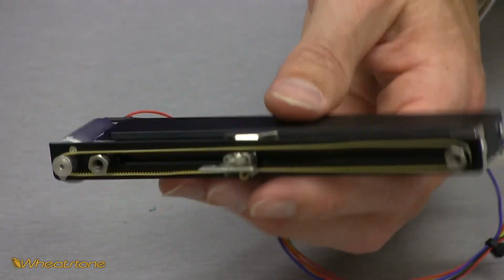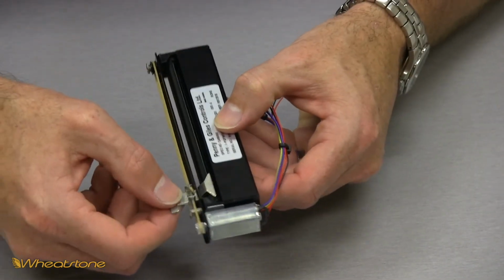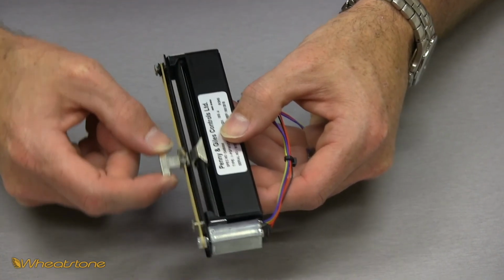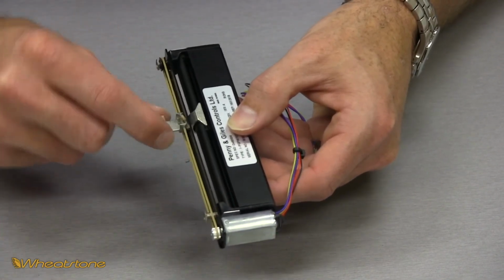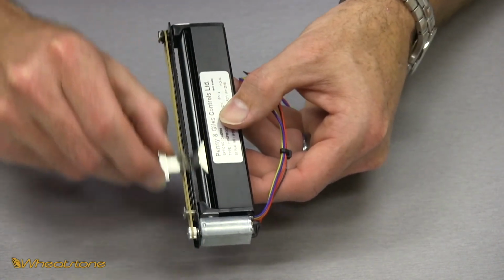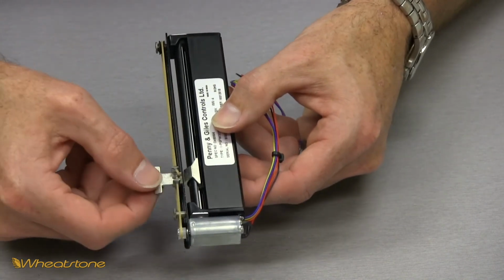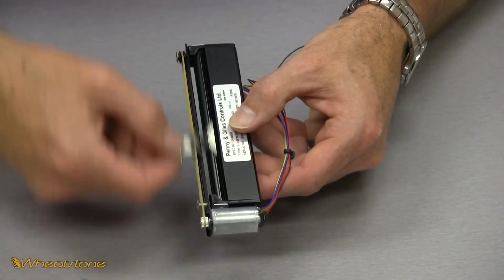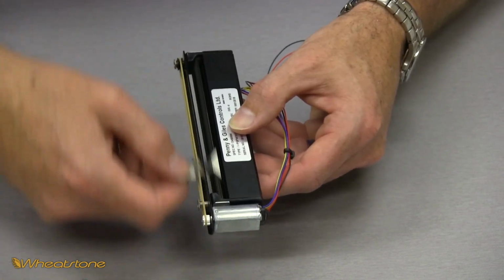There we go. Now you want to check the operation of your fader. As you're moving this up and down, I generally apply opposite pressure on the top and bottom of the fader arm for a couple swipes to make sure that one drop of oil we put on there is being dispersed everywhere around that shaft. So the whole shaft is lubricated by that one drop of oil. I'm not trying to overly exert any force, just enough to make sure the whole contact of those two bushings contact the slide. We're going to work that oil on that shaft a few times.